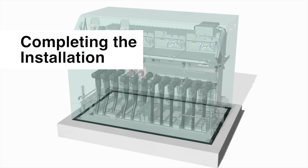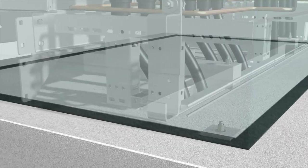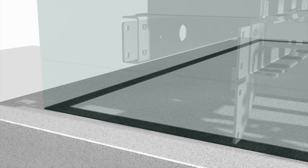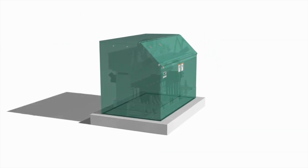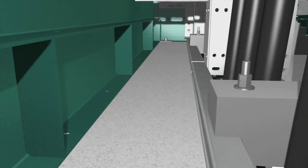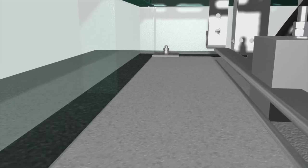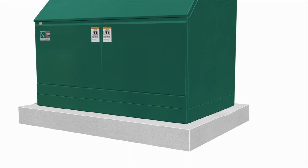A resilient closed-cell gasket on the bottom flange of the enclosure protects the finish from being scratched during installation and isolates it from the alkalinity of a concrete foundation. This gasket also helps to seal the enclosure to the foundation, to guard against entry of rodents, insects or weeds, and to discourage tampering. In the event the gasket cannot compensate for an uneven foundation, grout the bottom of the enclosure as necessary.